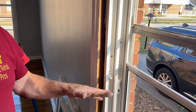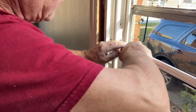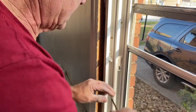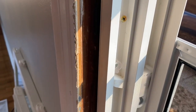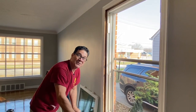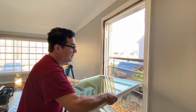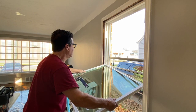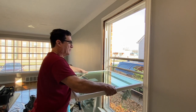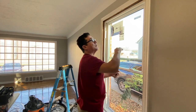Now we're going to put the sashes back in. With your screwdriver, turn this to unlock and lock it. We're going to bring it down about even with the other one and lock it in place. Remember, we need to put the top sash in first — the top sash doesn't have the locks on it. Always remember that. There's a 90-degree angle: put that side into the slot, then put the other side in. Turn it up to unlock it, release, and up. Nice and smooth.